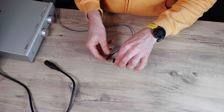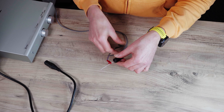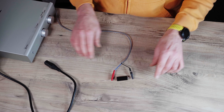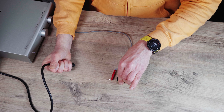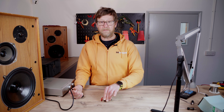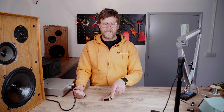I'm going to swap it round. You might want to turn the volume down while you're doing this — you don't want to mess up your speakers. Holding the wire there, it's plugged in. Do you hear that? So that confirms my suspicions. That end is the outer foil, that end is the inner foil. The outer foil end goes to the output — so the lowest impedance on the circuit.